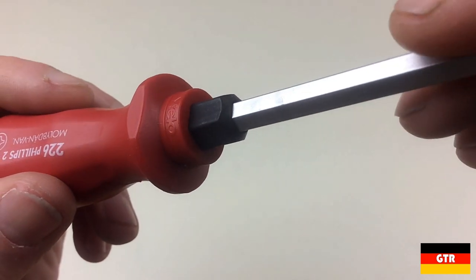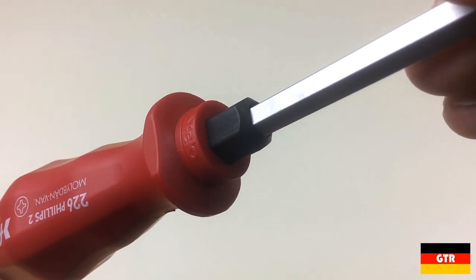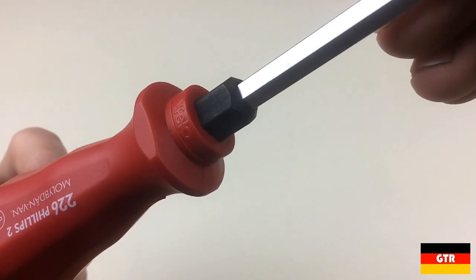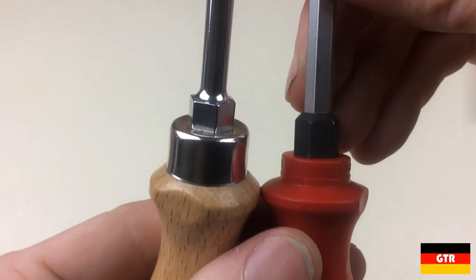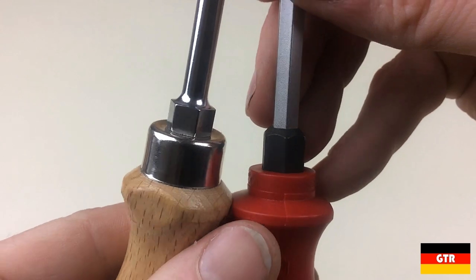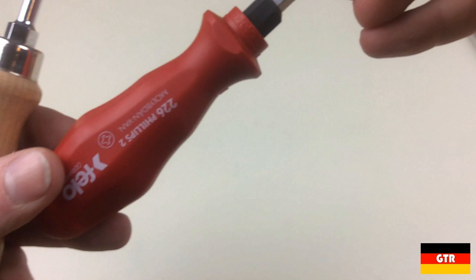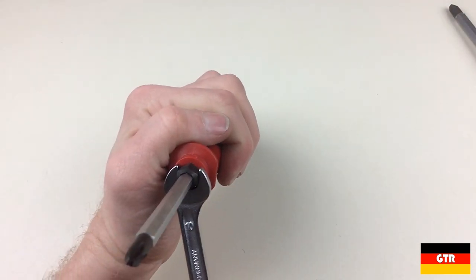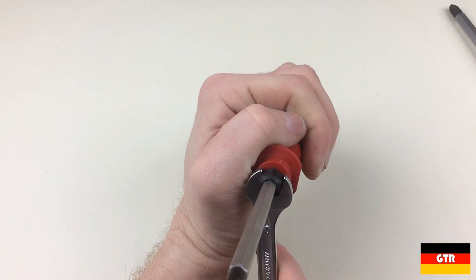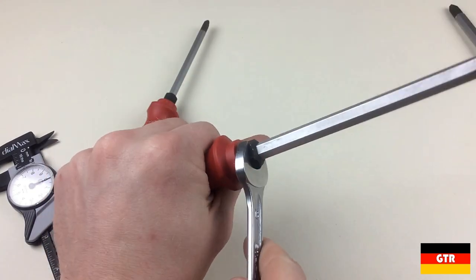Looking at the main features of this series, you'll notice quite a few differences from the wooden handled drivers. The first is the bolster nut on the screwdriver that allows a spanner to be used to gain more torque. The nut on the 206 series is black phosphated and is not created as one piece along with the shaft like it is on the wooden handled version. Instead, a hexagonal shaft is used and the nut is slipped on during one of the production steps. This nut will be either a 10mm or 13mm depending on the size of the driver. These bolster nuts come in handy especially when you need to turn a large slotted screw that has been rusted in place.